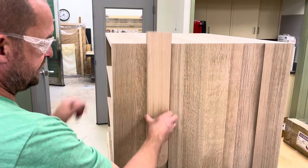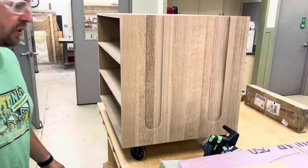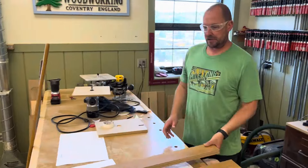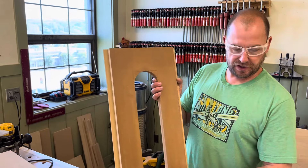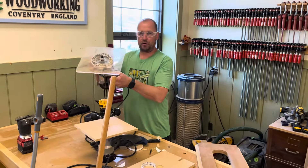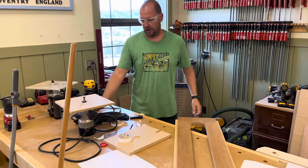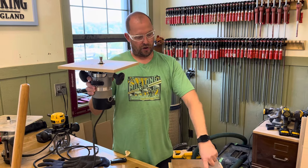It's going to have locating pins to adjust to different heights. Achieving this was quite a multi-step process. Back over here, you can see what was set up with routers and templates — this is the full-size template used, which provides the shape needed. The first step was to use a plunge router to waste out the middle section, which is three-eighths deep, then come back with another router to create the dovetail, with the bearing riding on the template.